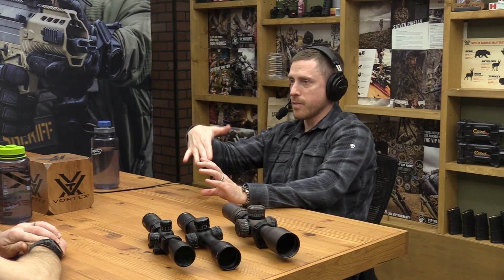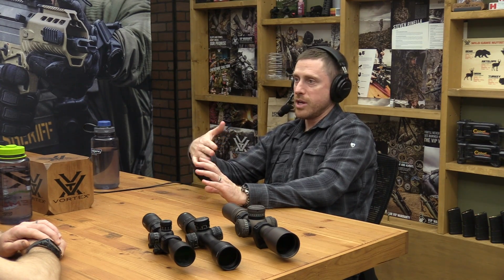So you might be looking at a more blurry part of the image, if you will. But like I said, you can design some of that out. You can get other things like vignetting going on, which is sort of that blackening. But yeah, you can design that out. And we actually will model that when we're designing systems. We'll actually model the different positions of the erector tube so that we know what's going to happen to the image when you move it into those areas.